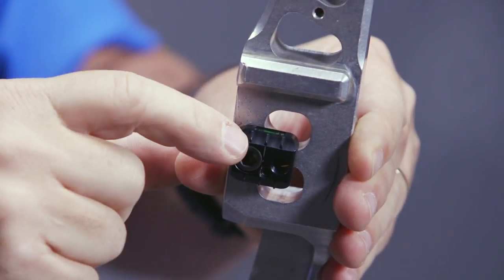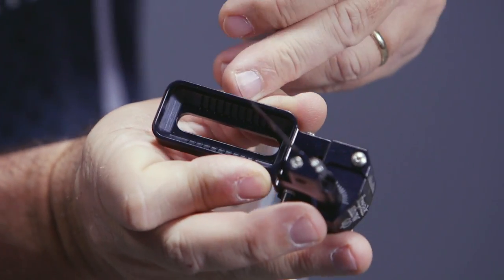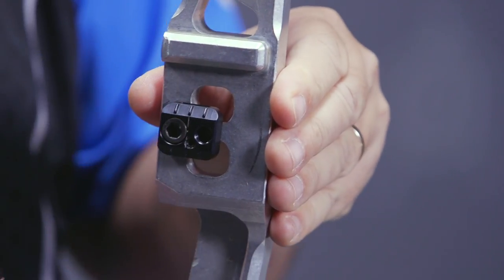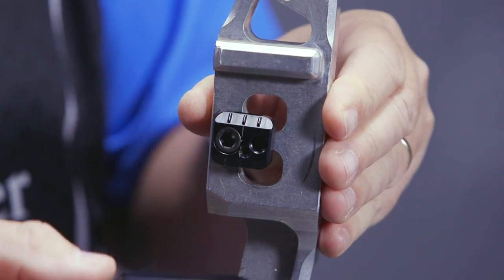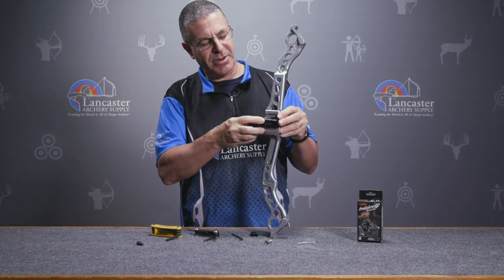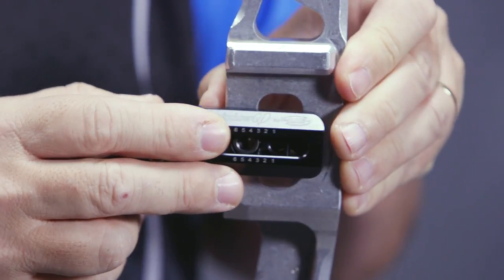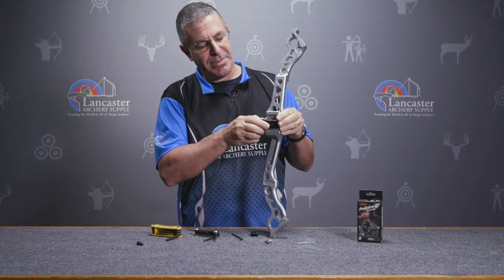On the top here, you've got these three teeth, and on the inside of the Freak Show arm you're going to see the lines that correspond to how they sit in those teeth. There's a little white line etched on the front there that's going to allow me to see where I am on this rest. Right now I am in the number four position — that line is right under the number four. If I want to move the rest back I can do that; those teeth are holding it in place. If I pop this off, all I need to know is where that white line is and I can put it right back to that spot.